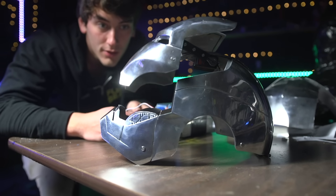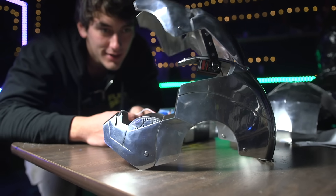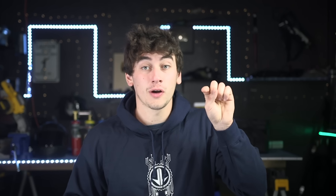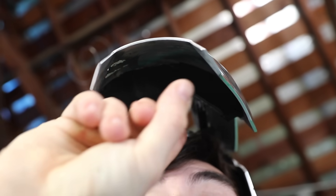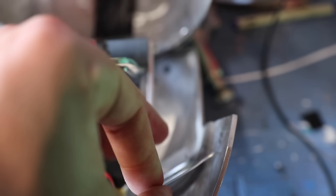Now we've got to put them in the helmet, which was much harder than I thought. Because we made the mask actually move already, there wasn't a lot of room for these glasses. The way these glasses work is they've got a tiny projector in the side that bounces the light into your eye off the special glasses lens. So I ripped everything apart and mounted that little projector right in the center, then put the glasses lens over one eye so it could still project onto that, and mounted all the other electronics onto the mask face. And now the last piece of the puzzle — myself. If I'm trying to play a genius billionaire playboy philanthropist, I gotta look the part.